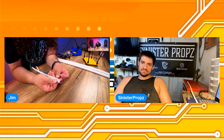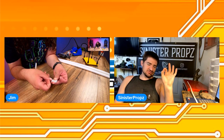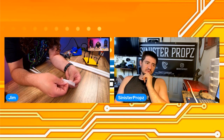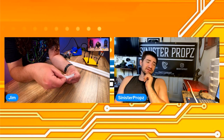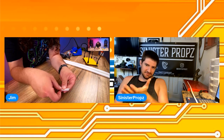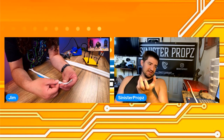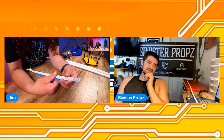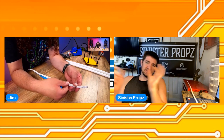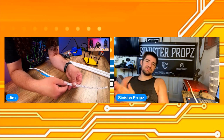So you started a little offset. Yeah, about a pixel offset, so the gap area between the two pixels, there's a pixel on the other side. So this reduces what the community calls corn cobbing. Honestly, I can't think of a better metaphor for what it is. If you look at the blade, you can see that there's NeoPixels and there's a small gap in between them. It looks like a corn cob. If you're looking at a corn cob, it's not a solid object. There's like little pieces, and this helps mitigate that.